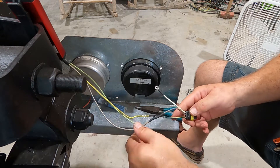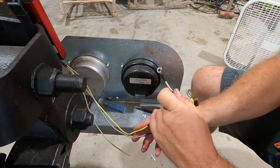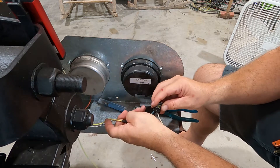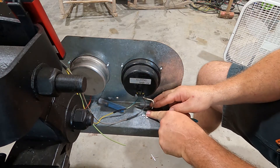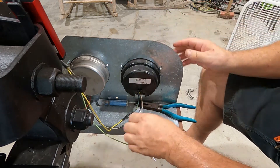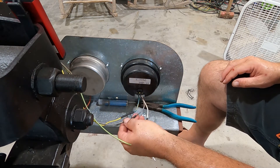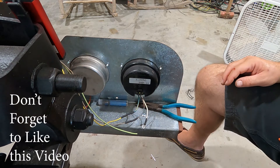This green wire goes to the backup light, and this is the ground for the tail light. Since the backup light is a metal housing, it's already grounded through its own body, but this tail light is not. When I plug that in, I'm going to ground it to this bolt here. I could move around to the other side and show you doing it again, but I think you've got the gist of it. That's pretty much it to wire up the tail light on this thing. We'll come back for the next step. Thanks for watching.